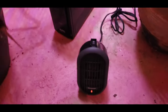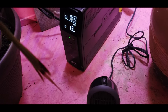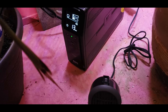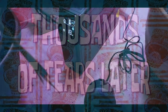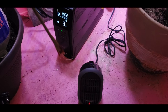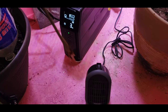There's a 170-watt load going — I can feel the heat from the device so we know it's still working, and the little fan's going. This is a continuous load. A lot of devices plugged into this probably wouldn't draw continuously. One thing I'd say is I probably wouldn't plug my printer into this — in case you had a blackout mid-print, it might suck out the juice quickly, especially a larger laser printer. This device has been running for about 14 minutes and just moved down to 3.